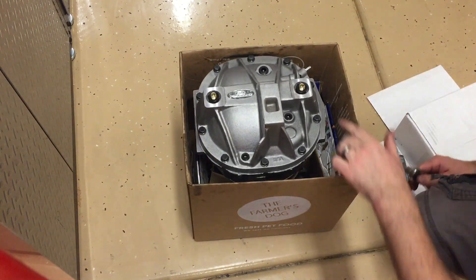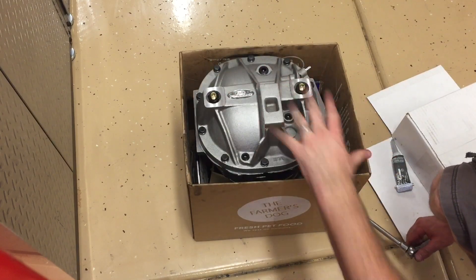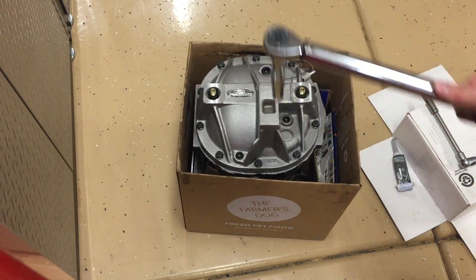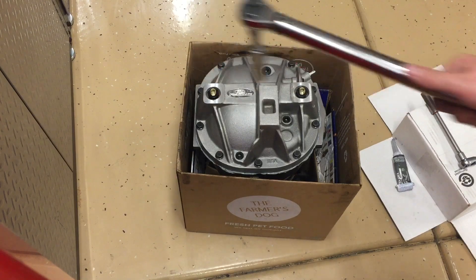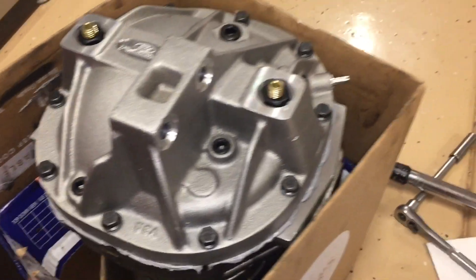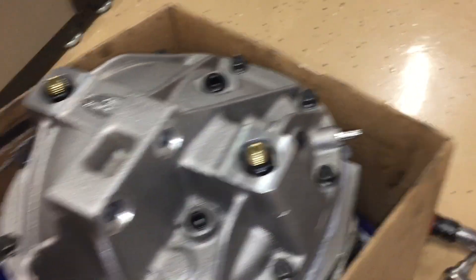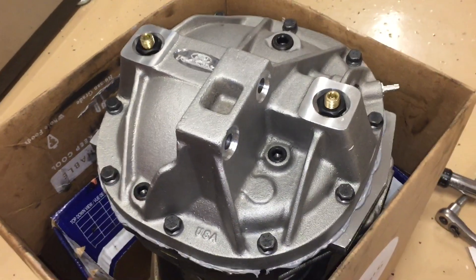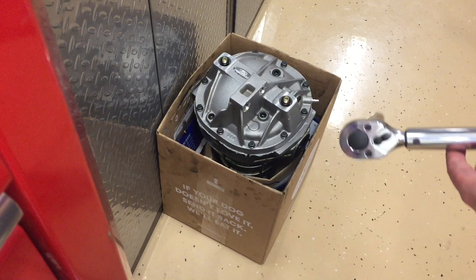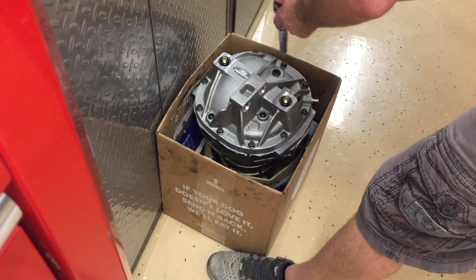You can see a nice little bead strip coming around the whole thing, so we know it's sealing properly. Moving to the torque wrench now, doing the same crisscross pattern all the way through. Everything's torqued down for the first round — you can see the RTV coming out, which is fine. I'd rather have a little too much than too little. It's been 10 minutes, so I'm going through and re-torquing these again, same pattern.